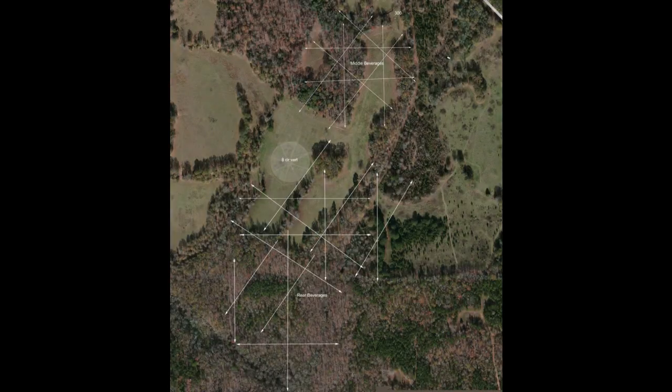Because of the nature of contesting, where multiple receivers and transmitters are operating at the same time, and also more because I like to experiment with receiving antennas, and that requires comparing one antenna to another while both antennas are operational over a long period of time, I have a lot of antennas scattered around. The ones far in the back that you see on the map are primarily reference antennas that are untouched except for maintenance, and they give me a basis to compare any new antennas or different arrays, any changes in the array. I can immediately compare the signal to noise ratio to see if I've done anything to improve the receiving